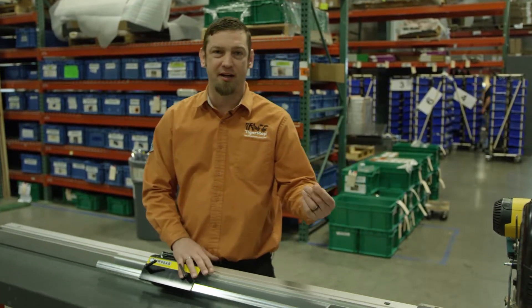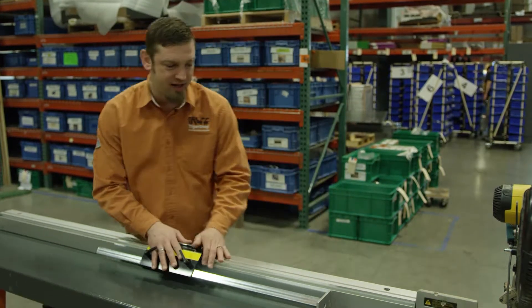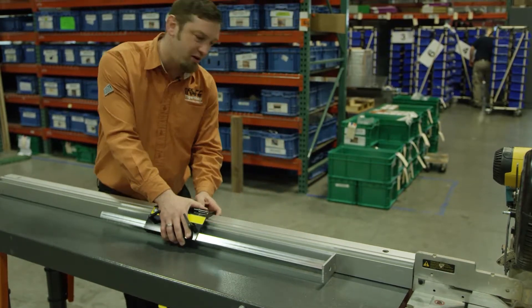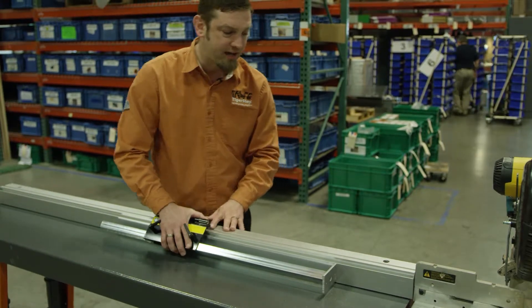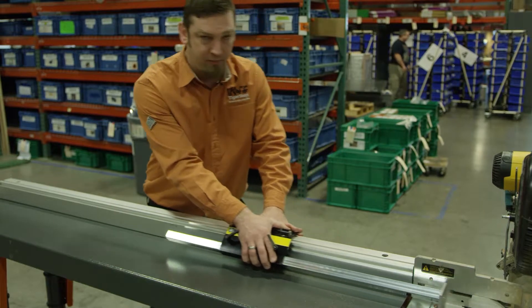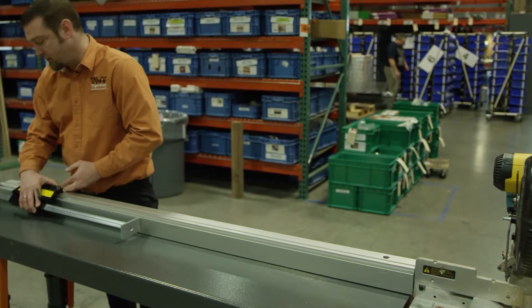We know if the power head spindle is spinning then the motor's okay, so we're going to check the gear here. We're going to check the belt, make sure that it runs free along the back, there's no burrs or anything pushing into the belt from the back, and that the carriage can run freely along the whole beam without binding anywhere.